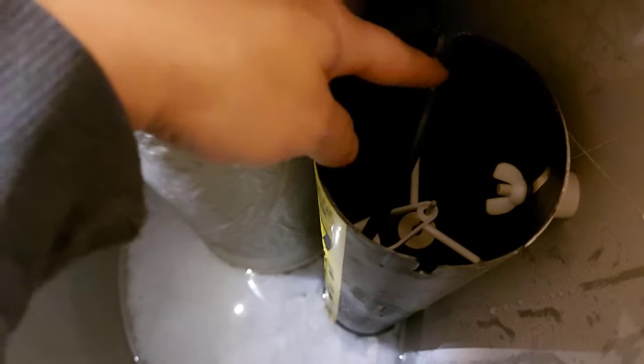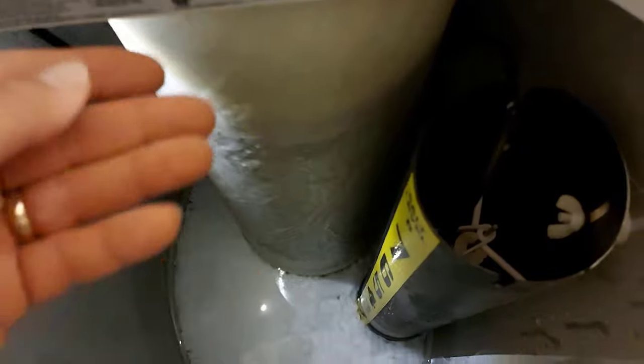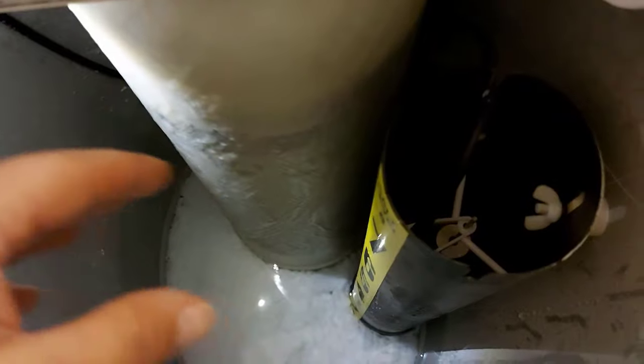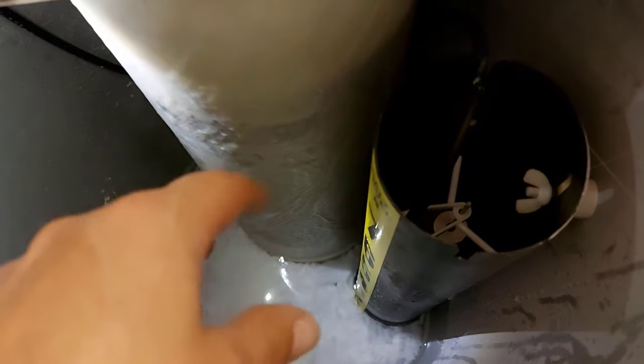The first thing I checked was taking off this cap — this is where your float is. There's a black water line here; if it's not attached to your float mechanism it will not be working right, so that could cause your water level to go up. Also, down at the bottom of this tube where your float sits inside, there are slots, and if those slots are plugged with salt that could be the problem because it's not getting proper water flow in and out of this tube.